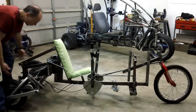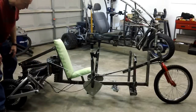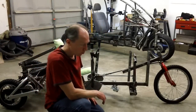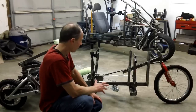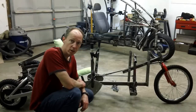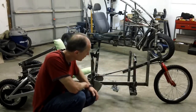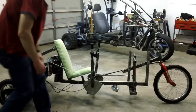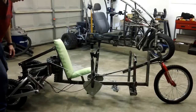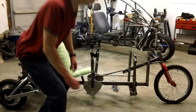When you have the rear wheels tilting over here, you've got to have chains coming over here to the differential and then the motor, so you end up with 3 chains on that setup. I looked at that strategy, but decided it was more complicated than I wanted to go with, and I've gone with this one because this is the simplest tilting design out of all of them. Having one wheel in the front simplifies the suspension and steering, and having the engine here on a platform that is not tilting, to be able to tie in the wheels, simplifies that tremendously as well.